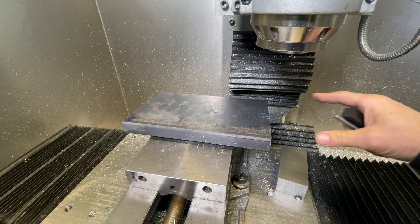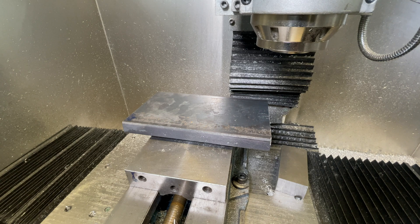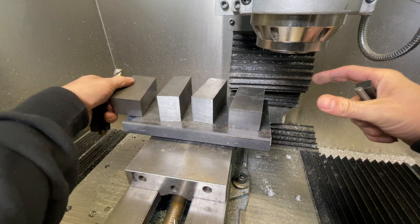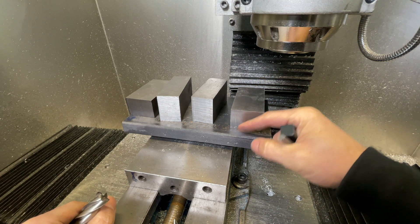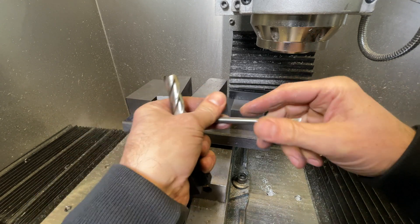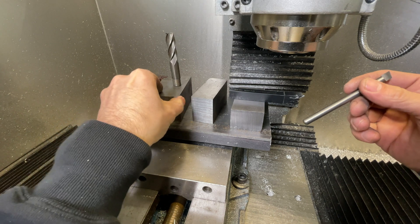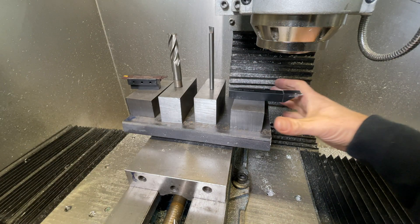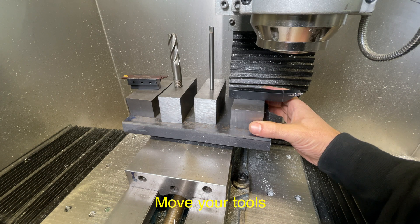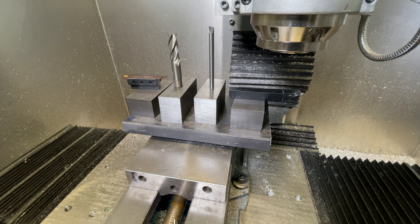So my solution to this is building a fixture that will hold at least four individual tool holders, which will have an inch-and-a-half slot and they will be bolted down to a plate. Once you have your plate and your Y's, you'll have different types of tools set up. The benefit is you're able to individually move your parts in the Y-axis for initial setup, and you can simply run a Mach 4 native lathe or turning profile without much G-code editing.